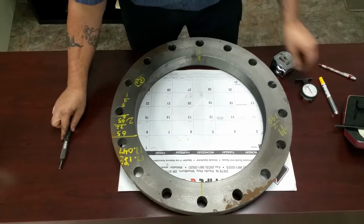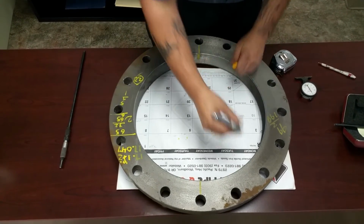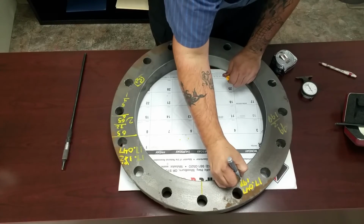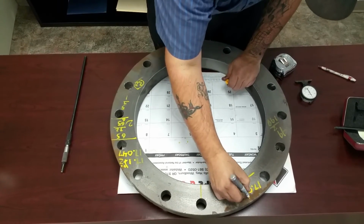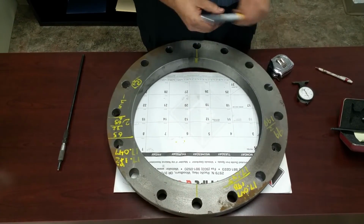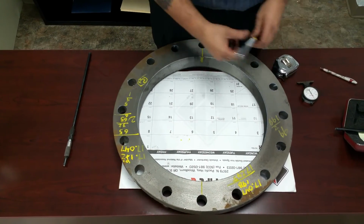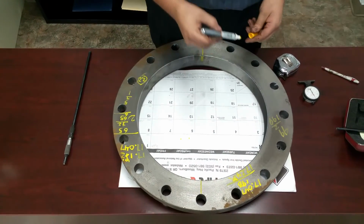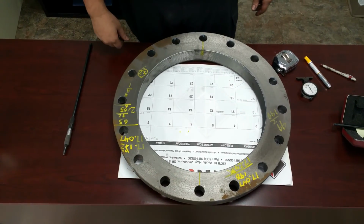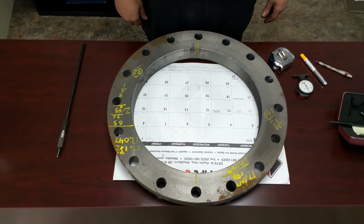Now that same number, the first number I chose, the one that's closest to the top where you're measuring, 17047, you're going to add your 198 to that. So your takedown, when you measure your OD of the pipe, is going to be at 17.245, which on the OD tape, you're not going to worry about your last number unless it's a 9 or 8. Then you're going to round your 4 up to a 5. And when you use this mathematical equation, your flange should fit on perfect every time.